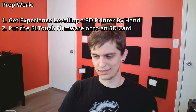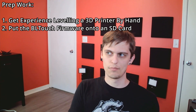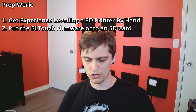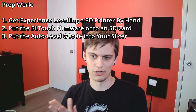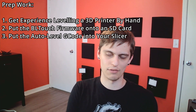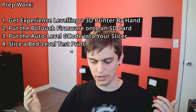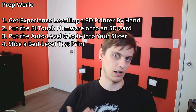Big note though: I downloaded the latest version for my 3D printer — that's not what you want. It has to match what's currently on there. If your 3D printer currently has version 1.11, make sure you download the 1.11 BLTouch firmware from Creality, not something newer or older. Third, take the G-code mentioned in the instruction booklet and insert it into your favorite slicer. Fourth, take a bed leveling test print and slice it with that G-code in there. I posted the one I used on Thingiverse — links in the description.